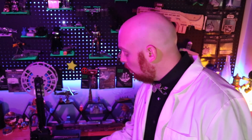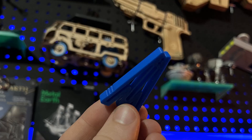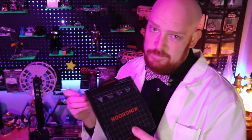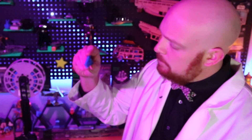And there we go — our first print all complete. Now I've gone ahead and turned off my printer, but typically you don't have to do this; you can just go back to that little motor off function. Let's pull a little bit forward here and take the magnetic mat off. We can take a little look around this ring here around our print to see if it did pretty well — and it actually looks really level. To take the print off the bed, if you've ever been to a stadium, you just got to do the wave just like this and the print will come right off. You do want to avoid touching the surface of your printer bed — you don't want the oils from your hands ruining the adhesion.